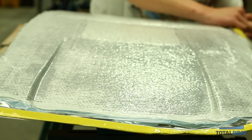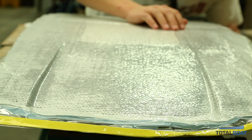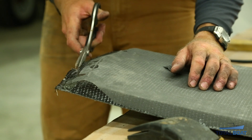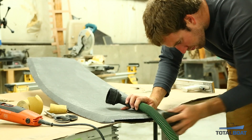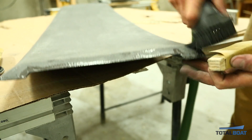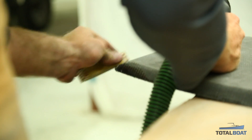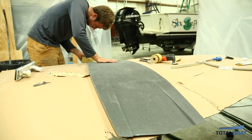Once we had that, we heated the whole thing — I put two space heaters on it and waited about three and a half to four hours. The epoxy wasn't fully cured but was cured enough to sand, so we were careful pulling it out. We sanded the edges down nice and flat, being careful not to go too far and burn through the two layers of carbon fiber. Now you have a nice clean shape.